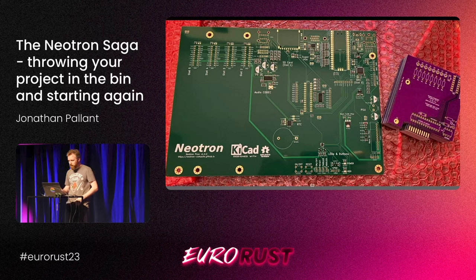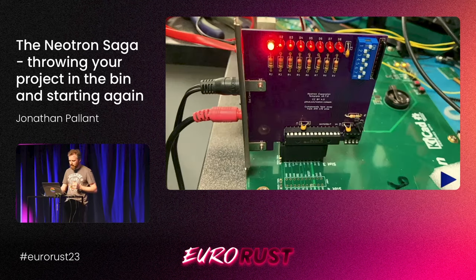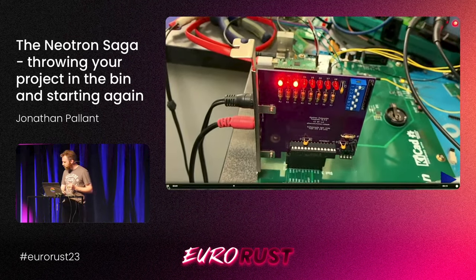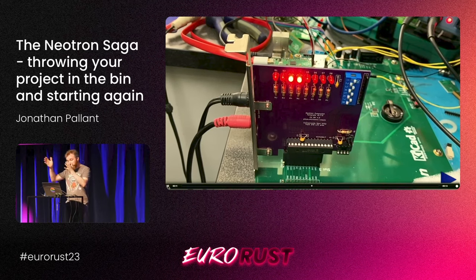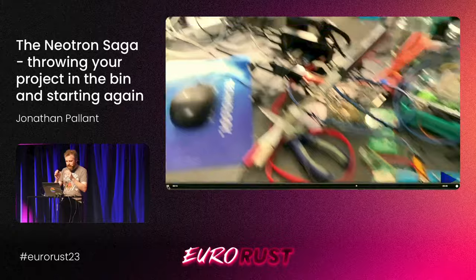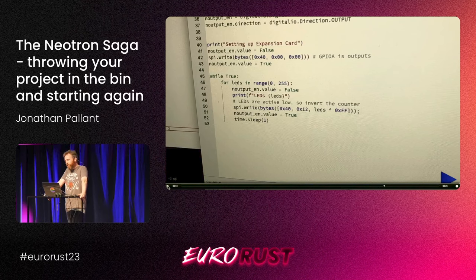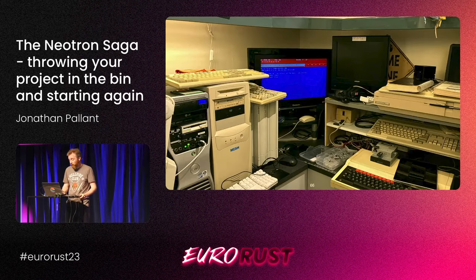Ordered more PCBs — making PCBs is fun and you should do it. The expansion cards have gone purple. I made five of these boards fully loaded. There's a lot that has to happen: there's an I/O controller; you have to tell it to select slot three on the bus, then slot three is activated and you can talk to the card. Here's the needle scratch — I'm testing my board in MicroPython. Here's a top tip: you don't have to write Rust — MicroPython is a perfectly cromulent way to test your PCBs. You can open a REPL and go: pin high, pin low, drive the bus. Do your own thing.